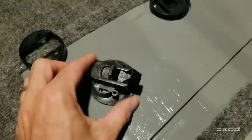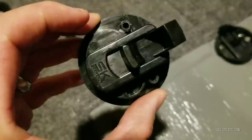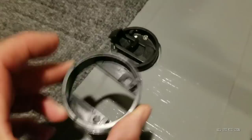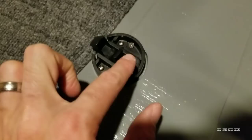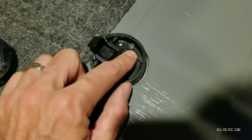Basically you're going to drill a hole through your hatch — this slides through, then this locks on with two little screws. Those two little screws don't do a whole lot because you're screwing into plastic and expecting this thing not to spin around or strip out. So what I've done is added extra screws through this part, kind of like a toenail — angled out — because your hole is cut and your latch is going through. That really pushes this down and holds it tight.